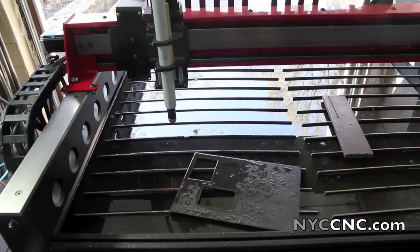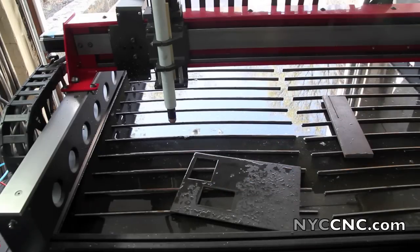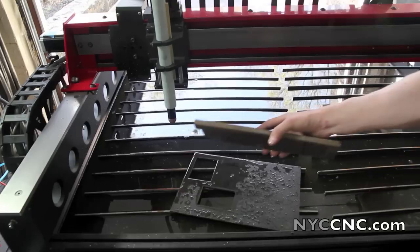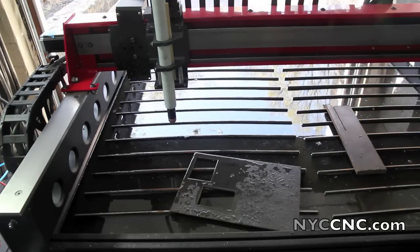What I thought I'd do is cut the same line test that starts at 140 and goes down to about 90, just so you can see it in action. I'll use the same piece of steel used for my first two cuts — this will be the third cut the machine has ever made. And then before I use up these 65-amp consumables too much, let's take a piece of half-inch and see what happens, which is a more appropriate thickness for the heavier amperage consumables.